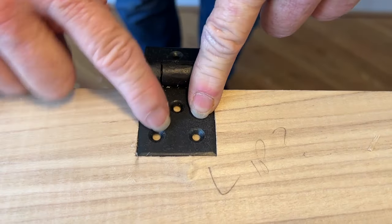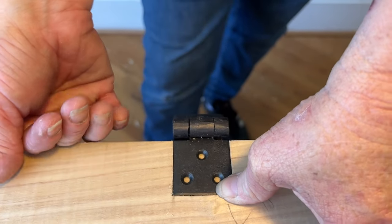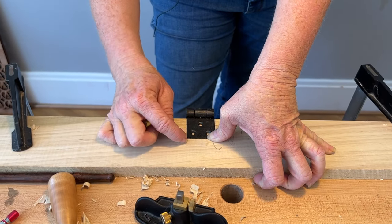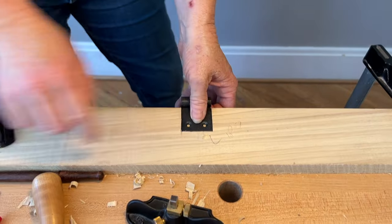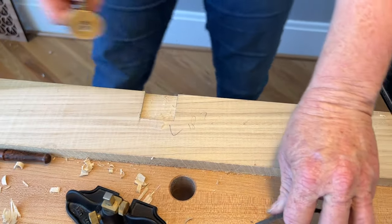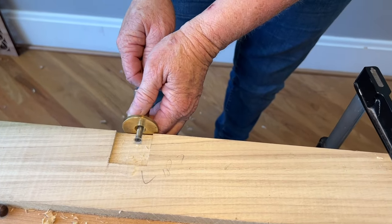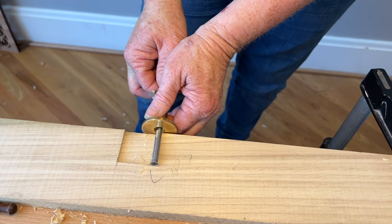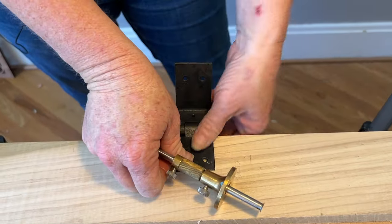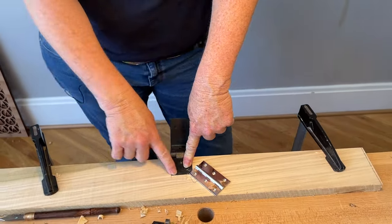It's level in the middle. The only thing I might need to change is that once I have it on the chest, in order for the lid to close properly — not bind and fit where it needs to — I may need to move it forward a little bit. No problem; I can move forward with my chisel or reset my cutting gauge to bring that line out an even amount all the way across and recut it as needed.